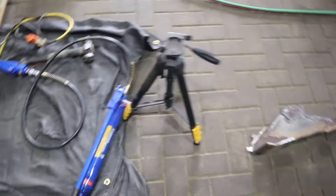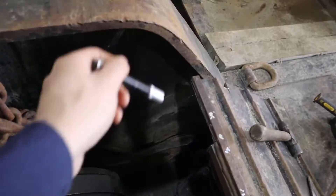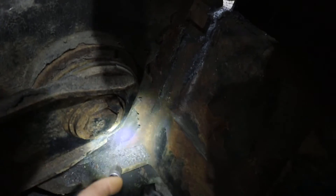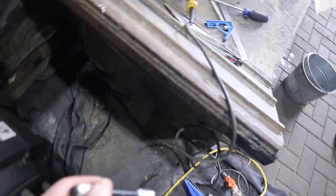I cut the access hole out — pretty complicated cut. I had to do some of it with the torch and some with a grinder. I try to do as much with the grinder as possible because it's a cleaner cut and leaves more material. Now we can see the full crack. It's a lot easier to cut that section out than cutting all these gussets and removing the whole ramp, which is how they originally thought they were going to have to do it.